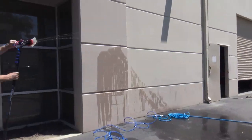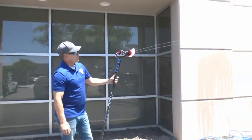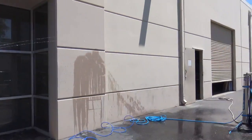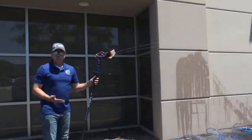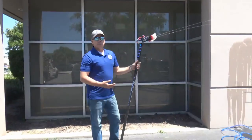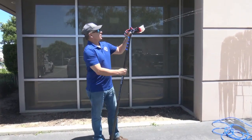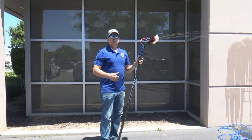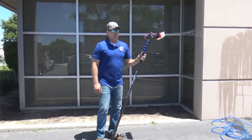I have a valve here that I'm going to shut off and convert to two jets. Now I'm shooting two jets about 15 to 16 feet. If you run into a lower pressure scenario where you might only get 40 PSI from the building, you may want to convert to two jets for those situations to ensure enough water flow. But typically you're going to want four jets — it'll speed up your process and efficiency of cleaning windows.